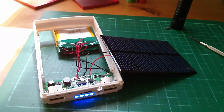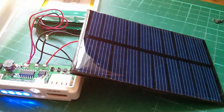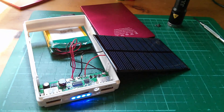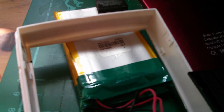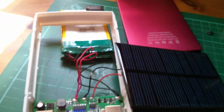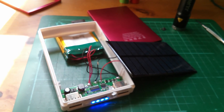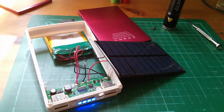Solar panels are all about size, and something this small is only capable of generating about one watt — it's just not worth it. It's so much more sensible to go for a big solar panel and charge big batteries. These small solar panel devices are really not worth bothering with. I can't recommend this solar power bank: the solar energy harvesting is very poor, the storage capacity of 4,800 mAh isn't spectacular, the 30,000 mAh printed on the back is a downright lie, the physical construction is absolutely terrible, and the circuit looks old school. I'm almost considering not putting it back together and using those lithium cells for something else.